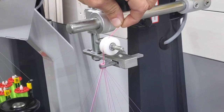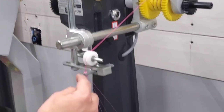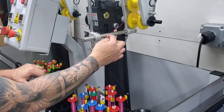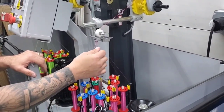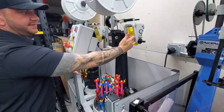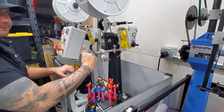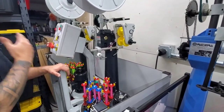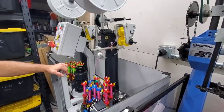And there's a shortage there of one strand for a while. Normally when that happens, you will have a section here going in that will be tighter, because what causes this to break is one getting held up and it will cinch down. So like your last video on the one line, you had that, and I even told my wife, I said, when you found that, there's a break somewhere further down. And you saw me going. You found it, because it will eventually just give out and break. Wow. Yep. See, and I didn't know none of this, guys.